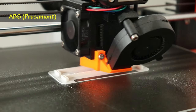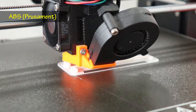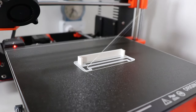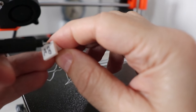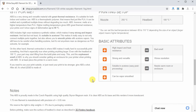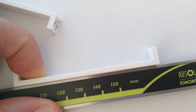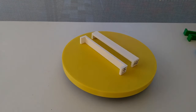The fifth filament is ABS in white color. ABS is the most common material for car interiors — but as an injection-molded object, of course. The heat deflection temperature is theoretically 98 degrees Celsius according to the website, though usually it is a little bit above 90. To quote the website: your print won't show signs of deformation up to 98 degrees Celsius. ABS is hard to print on an open FDM printer to avoid warping — you need an enclosure — but these objects are very simple so I didn't have any problems.